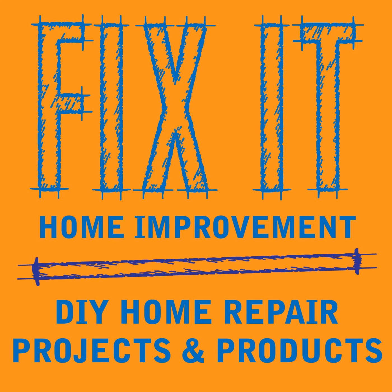The Consumer Product Safety Commission says there are about 400 people every year that are electrocuted. To replace a single-pole switch, you can turn your light on if your switch is working, then turn off the power to that circuit and your light is going to turn off. Turn off the breaker, or if you have a very old home, remove the fuse. Remove your cover plate. If you have an older home and they've painted over the covers, you can run a utility knife around the cover plate to break through the paint so it doesn't tear your paint.